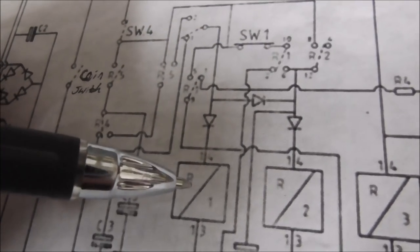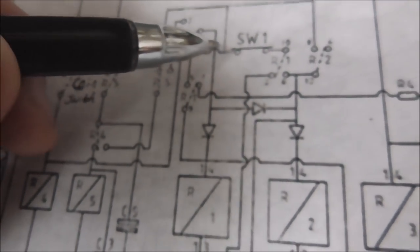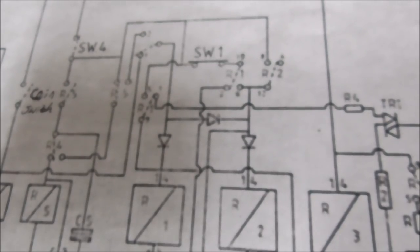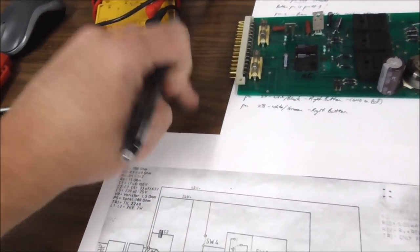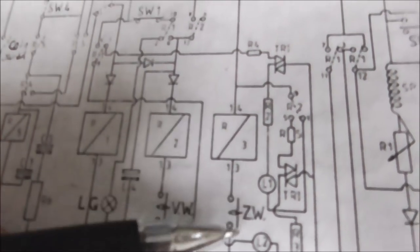Fascinating. So that would mean relay 1 would still be on, because, see, look, it's coming through here. So relay 1 would hold itself on, but relay 2 would only hold itself on until switch 1 opened up. Interesting. All right. So once it does that, you've moved back. And if you remember, that's how they operate. You can move it back, but then it stops. You can't hit it twice. So once it does that, all you can do is hit the one that goes right. Okay. So here's the one that goes right. So we already know that that one works.